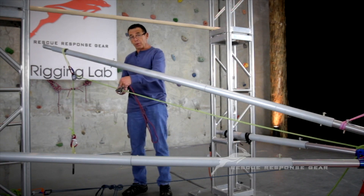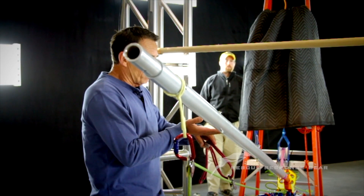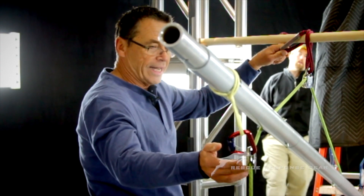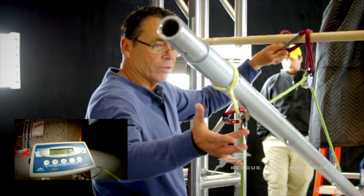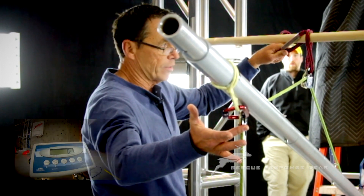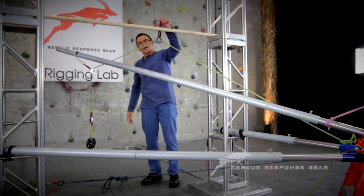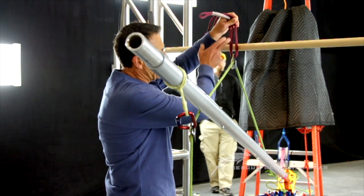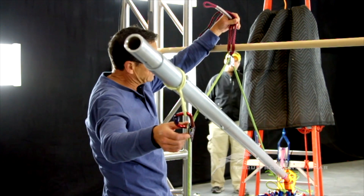Whenever possible, maximize the compression of the anchor and try to minimize the tension. By maximizing the compression of this lever, we should further reduce the leverage at the fulcrum. If I raise up from here, we've taken it down to about seven pounds on the load cell. If we could take this all the way to zero — where it's coming straight down the compression member — it's down to zero right now. The best example of this: look at cranes at a construction site. Crane manufacturers are great at maximizing compression of the crane by manipulating resultants, using a masthead or high directional to take the resultant at the end and drive it back down the crane.